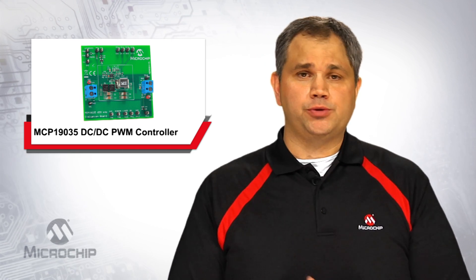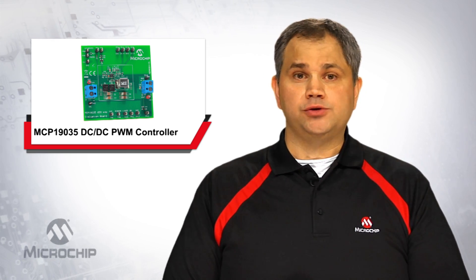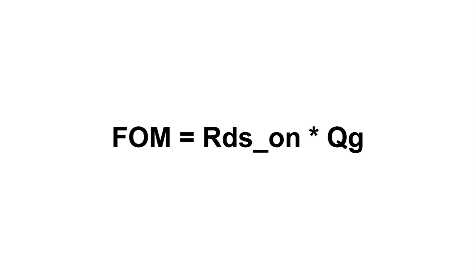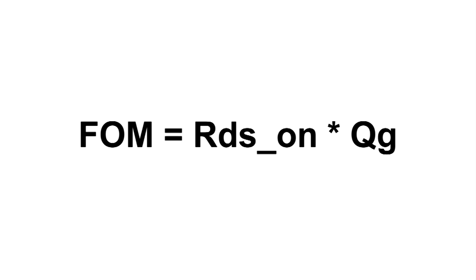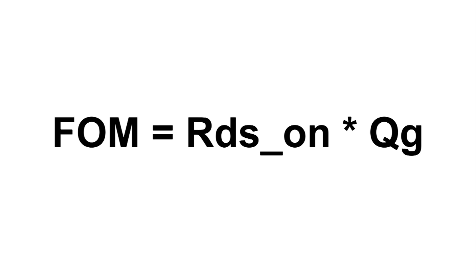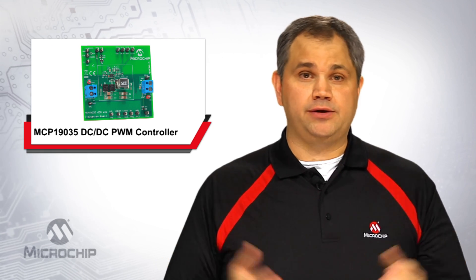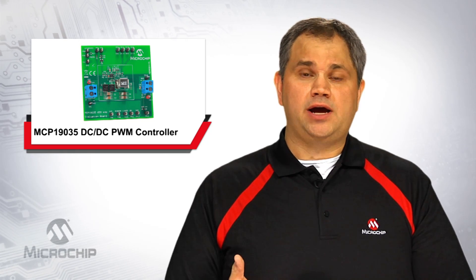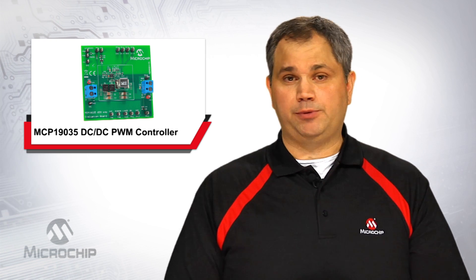Overall, the MCP19035 is a very solid and fast analog-based DC to DC controller, but that's not enough. We took care to design it to work with the industry's latest low figure-of-merit MOSFET devices. The figure of merit, or FOM, of MOSFET devices is the on-state resistance in milli-ohms multiplied by the gate charge in nano-coulombs. These two variables — on-state resistance and gate charge — are representative of the two key loss mechanisms in switching devices. For today's low FOM MOSFETs, you typically see FOMs in the low 30s and even down into the mid-20s. Just a few years ago, low FOM devices could be 90.